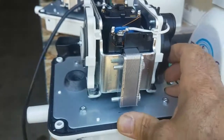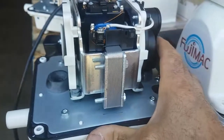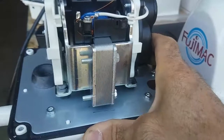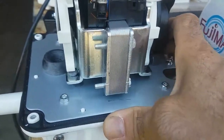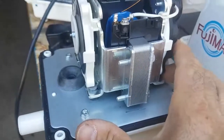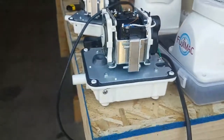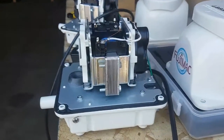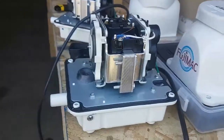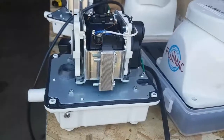If this pump is dropped, a sharp impact will cause the actual pump assembly to move so much on its mounts that it pushes against the edge of the rubber boot and will snap the neck off. The cure is no rough handling — don't drop them. If you drop the pump, there's a good chance it could break.